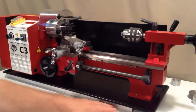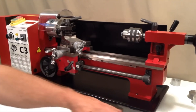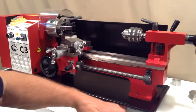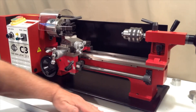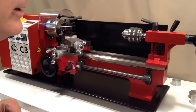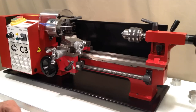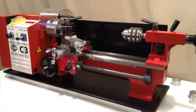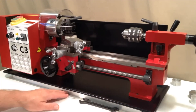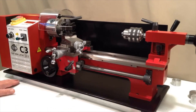Down below here I have a piece of aluminum angle — that's not something that comes with the lathe. But I like to put it there because the rubber feet that support the lathe raise the tray up about an inch above the surface of the bench, and unfortunately that makes a great place for things to roll under there — drill bits, anything round, even wrenches. Once they get under there they can be hard to find. So putting a piece of aluminum angle there prevents 99% of that from happening. On my own lathes, I have the lathe mounted directly to a laminated benchtop, so I don't even need this — but I'll talk about that in another video.